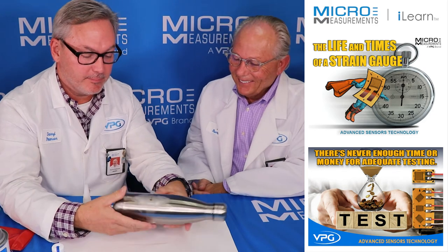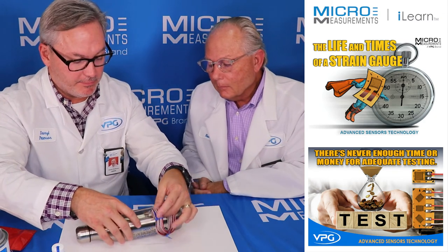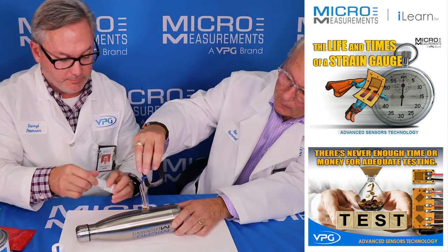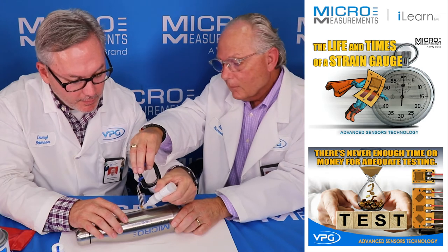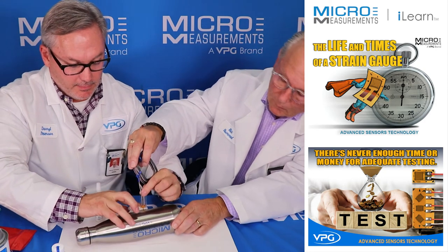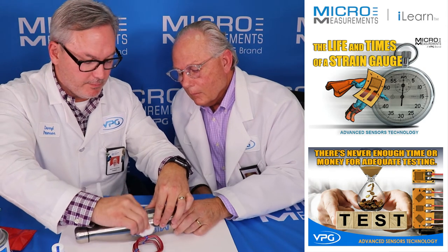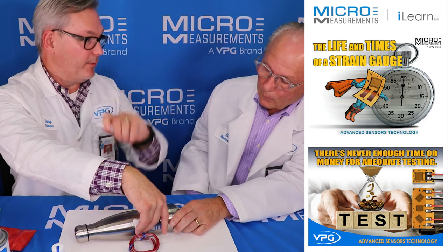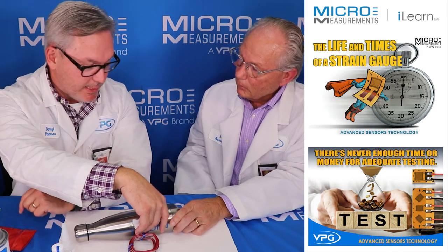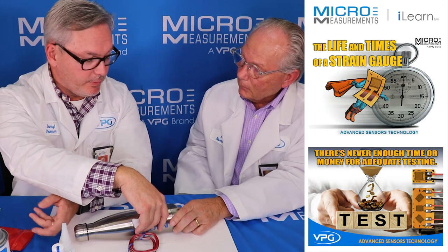Well past a minute, Daryl. At this point the gauge is installed. I'll put a little bit of adhesive on the flex and glue that down on the other side — lift this up just a little bit, put a drop of adhesive on the flex circuit, take the gauze pad and wipe it over into place, wipe the tape back down, and run my finger over it. Another full 60 seconds of thumb pressure. With M-Bond 200, you put one minute of thumb pressure on it, let it sit for two more minutes, and then you can peel the tape off and start testing.